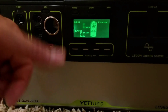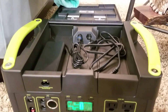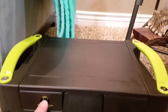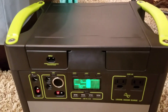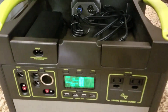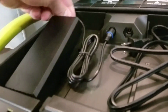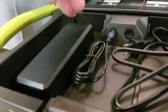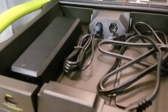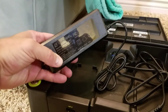It also has USB at 5 volts, 2.4 amps per port. I plugged it in last night and found that with the lid closed — you can plug it in as such — it came back about four hours later and the unit had gotten pretty warm. So I popped it out of the latch and kept the charger separate from the other plastic, left the lid open, and that seemed to control the temperature pretty well — it wasn't warm after that.